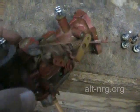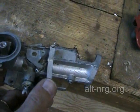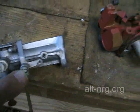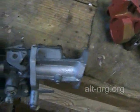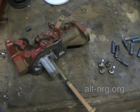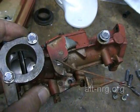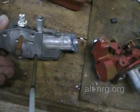The engine runs at approximately 3,400 RPM. The older style carburetor was designed to be a variable throttle, but the mounting screw is in the same position as the frame for the spring. The only thing I'm going to have to change is drill a small hole right about there to match the old carburetor, and I should be able to utilize that linkage one-for-one to turn this carburetor into a constant speed carburetor rather than a variable speed carburetor.